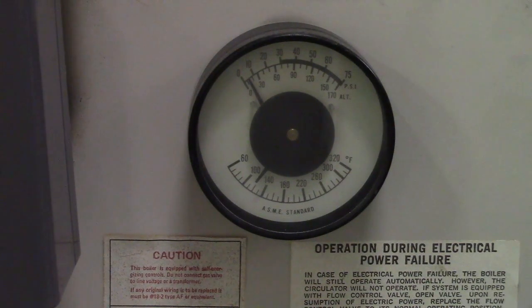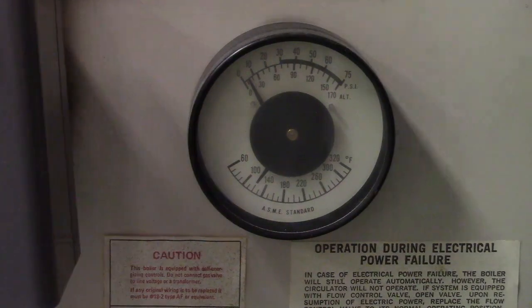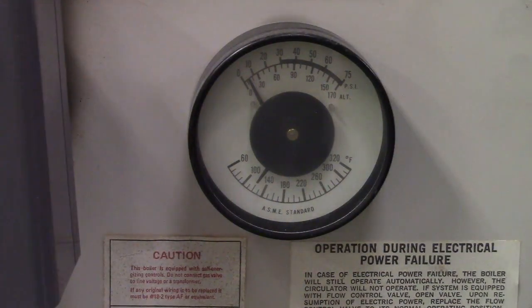the upstairs pipe is getting somewhat a little warm. The main center pipe is getting hotter. That's good. The basement zone is getting warm as well. They're not going to be as hot as the center pipe here because that pipe is the water direct out of the boiler, and these pipes going into the circulators are the returns, if you will.